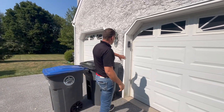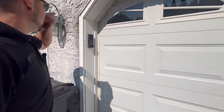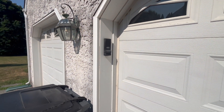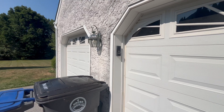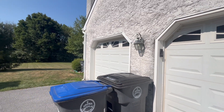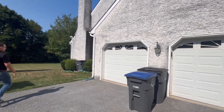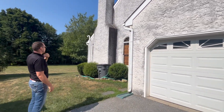Here on the garage side, we're taking off the old wood trim and replacing it with Azek — a nice wide composite trim that never needs to be painted and never rots out. All the stucco will come off this end by the chimney. You can see how bad the streaking is over there.